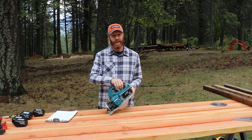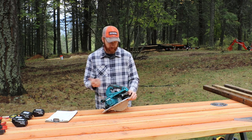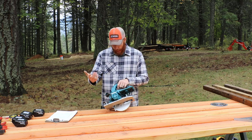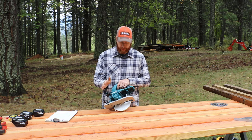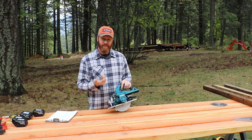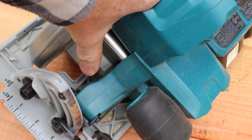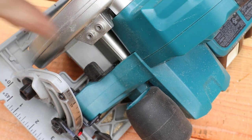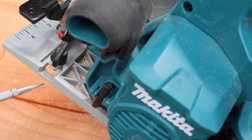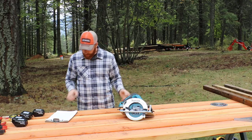That's one thing on the Skilsaw style where it's actually really challenging to get your hand underneath there and pull the batteries out. Sometimes they get stuck in there with sawdust. The housing is all impact nylon reinforced plastic or whatever here, whereas the other Skilsaw style, it's an aluminum housing. So it's got our blade lock there just behind here for locking our blade when we want to disconnect it. And then it's also got an optional rip fence guide bar slot here with a set screw to lock it off. So all in all, it's not too bad.